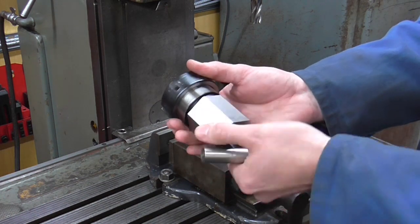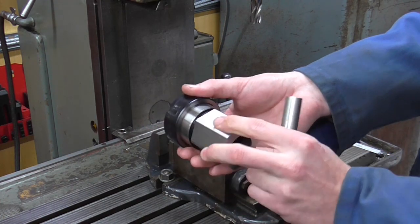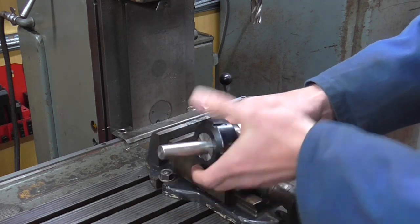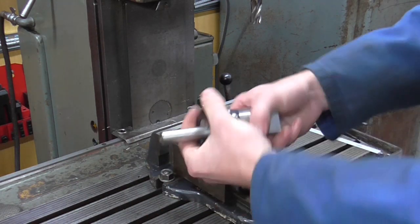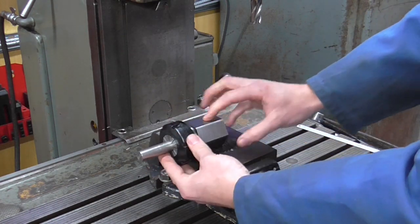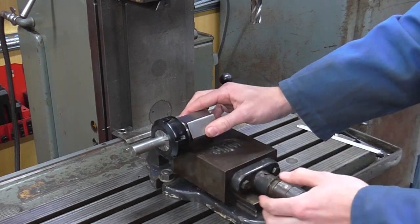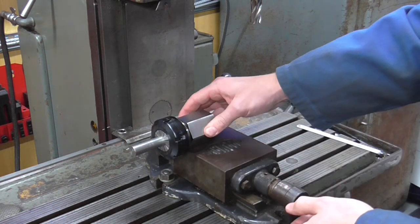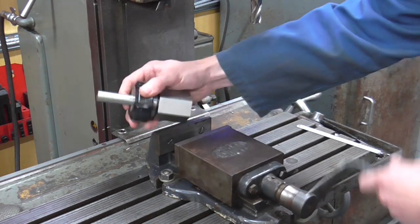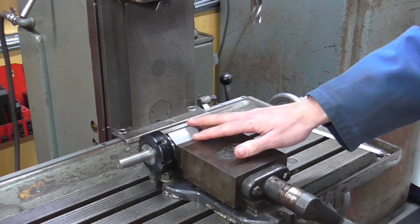This is a ground-up steel block that accepts a normal ER-40 collet. It's all nice and accurate — the bar is offered up to the collet and indexing can then be done by means of these reference surfaces. By rotating six times I have effectively indexed the part six equal times. Typically when a collet block is used it's placed in a vice and the flats align everything.